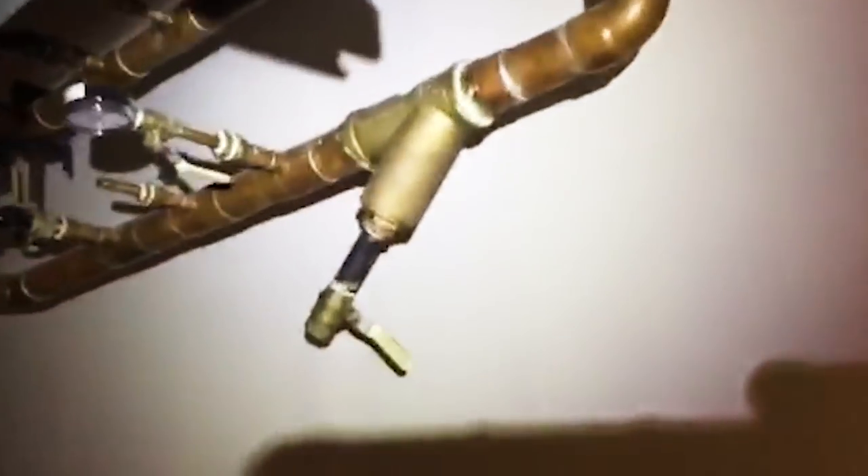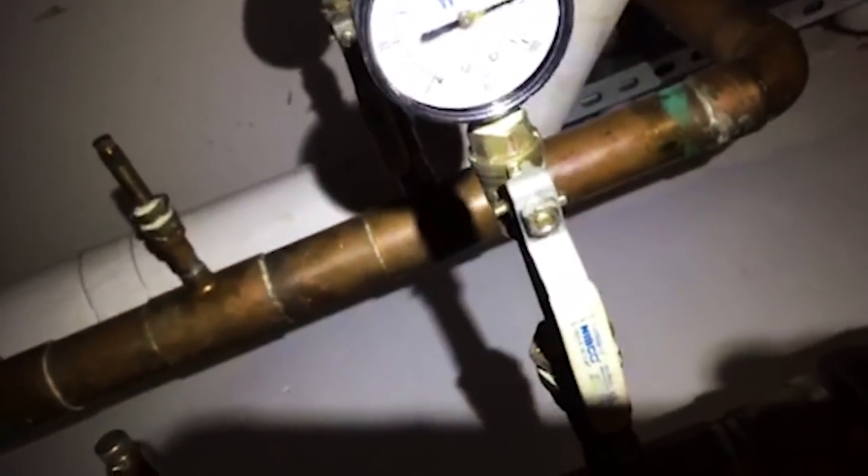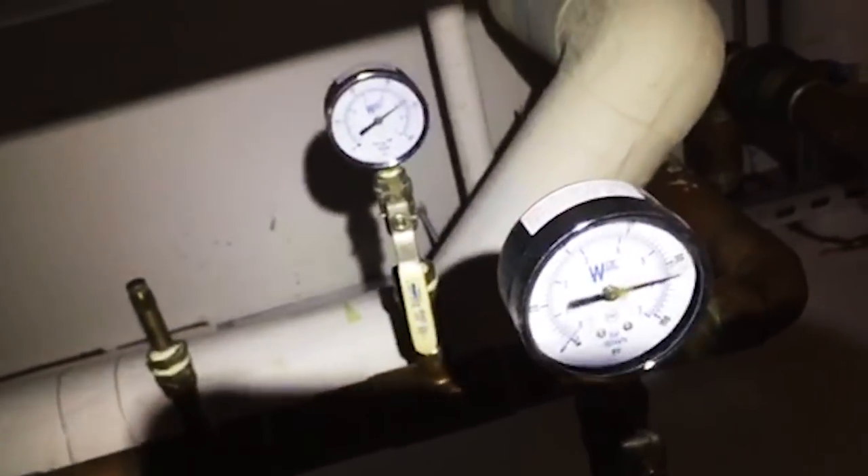Continuing on with the water source equipment itself — here's an example of one. Got our reversing valve, compressors, heat exchanger in the unit. This is actually a water source chiller — kind of unusual, but they make all kinds. So there's our chilled water piping and our closed loop piping. Got another Y strainer and our gauges — you can see that one's just over 80, that one's just over 70, so about a 10 psi difference.